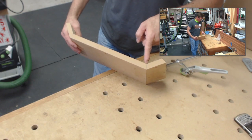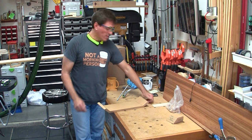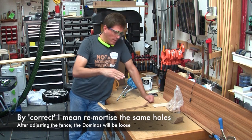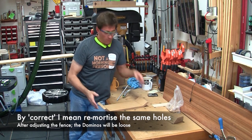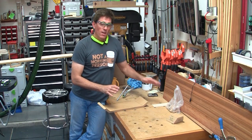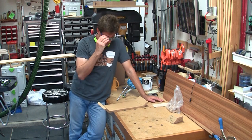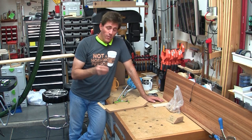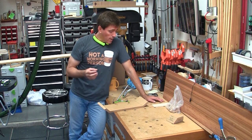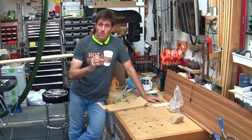I'm going to be getting an exposed crack up here. That's actually one of the benefits of using an epoxy — if I want to correct this, I'll make the domino holes a little bit wider so the domino can pivot in there. I want to be able to glue it so it's dead flat, dead flush. If the domino isn't touching all the walls, I don't really care, because the inside is all end grain anyway. What I'll do is first size it with a thin epoxy, then put it in with a 404 filler — that'll make an absolutely rock-hard joint, especially because it's got the tenon in the middle of it.